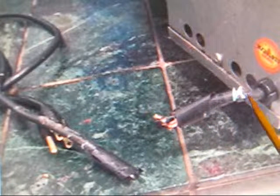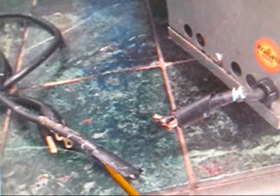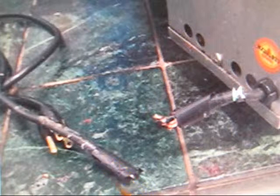Let's take a closer look. This video clip shows what happened to one power cord on an Awok juicer, and as you can see it's broken here. The first thing we need to do is take this grommet out, pinch it with a channel lock pliers or another method, pull the power cord out, and we're going to have to cut the power cord here. Then on the power cord side we're going to cut it here, expose the wires, and I'm going to show you in the next clip what to do.